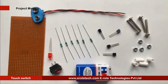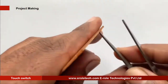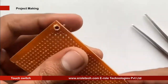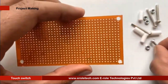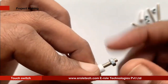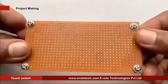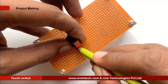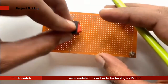These are the components we will use to make our project. First of all, we will make a PCB base — we will take a 0 PCB and make a hole at each of its corners. Now we will insert a 1 inch screw inside each hole, then take a plastic spacer and use a nut to lock the spacer. Now our PCB base is ready. To switch on or off our project, we will use an on-off switch — we need to make a big hole to fit this switch on the PCB.